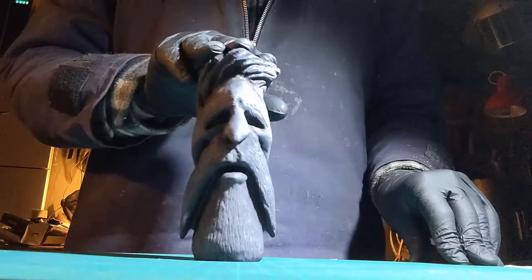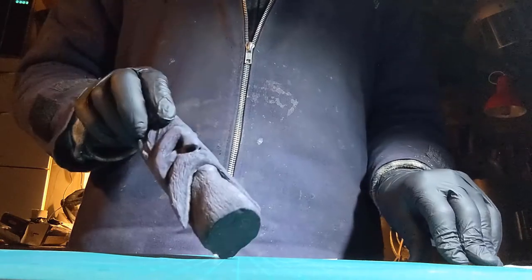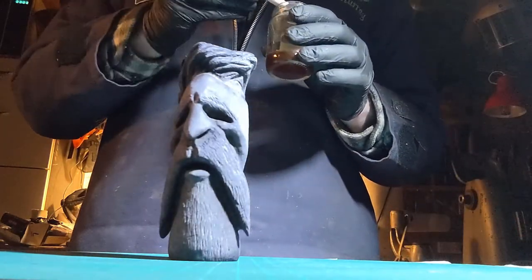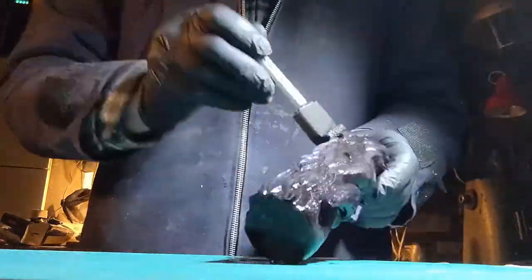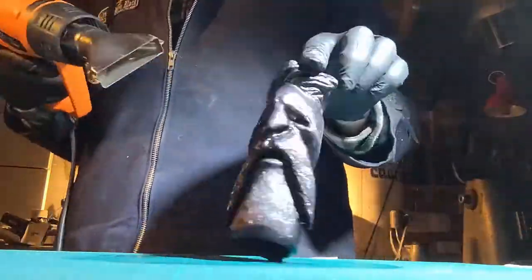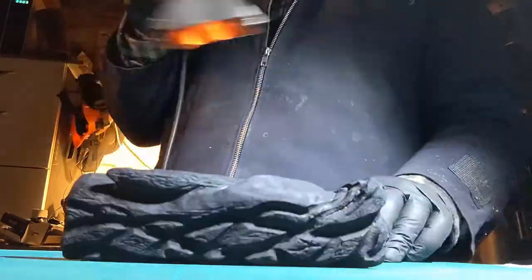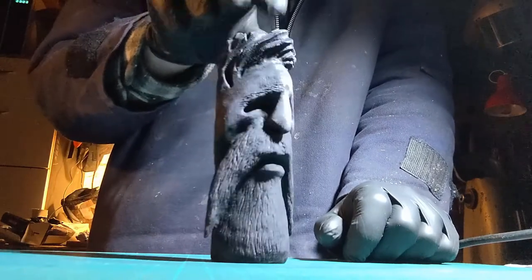You've got to be careful with your heat, because too much can crack your wood. So just keep it gentle. I'm just hurrying with this because I don't want to bore you for too long. Anyway, we're back to the second coat of tannin juice, and that's reacting with the ebonizing juice that's already on there.